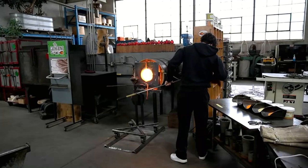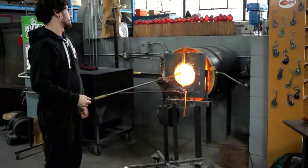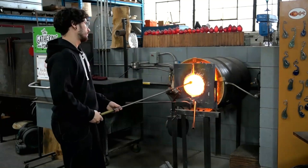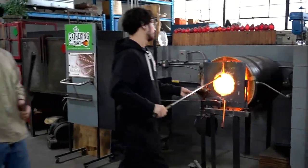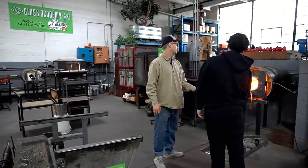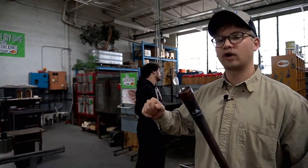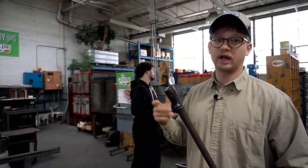So it didn't explode yet. Get it real slow and tender into that situation. Especially when you're doing overlays and you're working with a bar color and you want things to be as symmetrical and stable as possible — you really don't want to have any extra bubblage. When I'm doing a really tiny gather, it's glowing a little bit red, which is really nice. I'm going to set this up on the furnace sill while I rake the furnace so it really gets hot. With a thick pipe like this, I'm only going to get that much glass on the end.